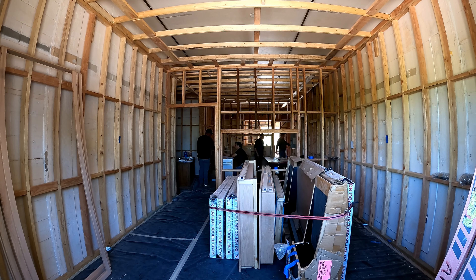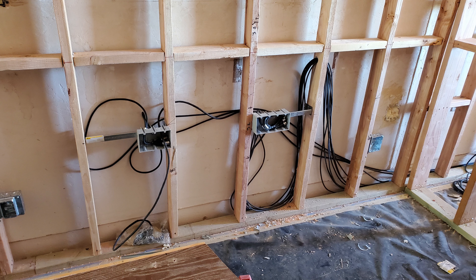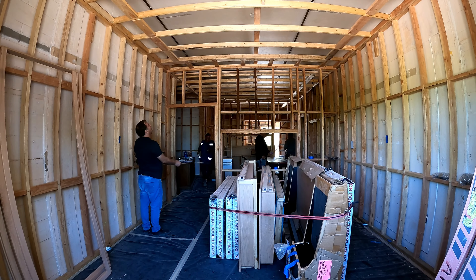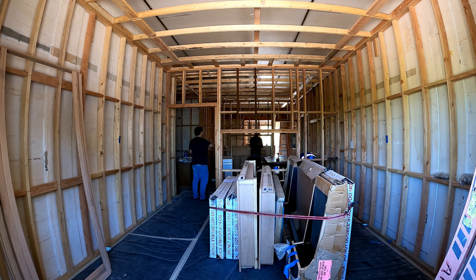One of the things you have to keep in mind when doing acoustic installations is that wall thickness becomes really thick because of all the layers and barriers you're putting in. In this situation you can see we have a special box that ratchets out — depending on how thick it is, you can actually screw it in or out of the wall to get to the right length, and these are a must-have when you're doing multiple layers. We have a little bit of space — the mineral fiber that we're putting in is only two inches thick and you have about three or four inches before you hit the existing wall. The reason we didn't put a lot of airspace here is because it's an RV garage — it's already slender to begin with and we don't want to end up with a five-foot-wide room because we put too much isolation in.